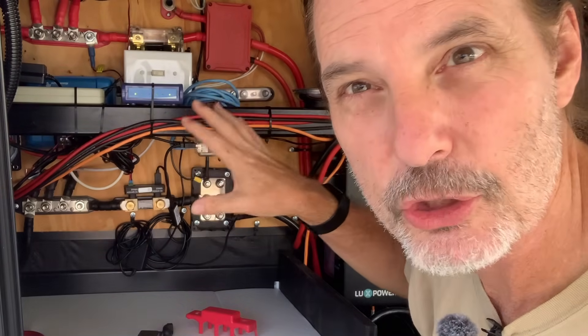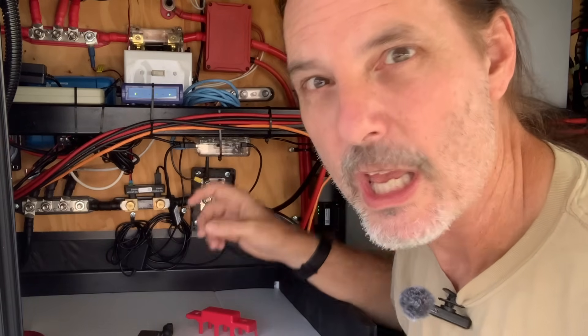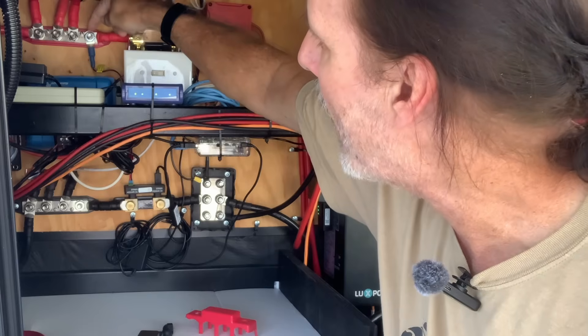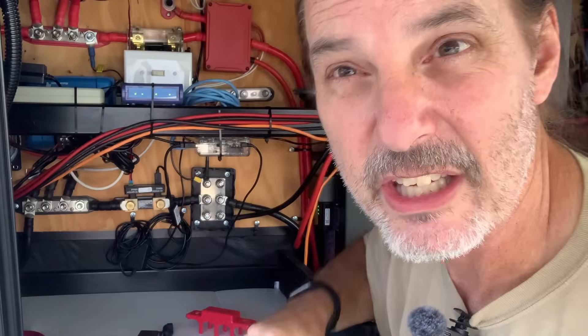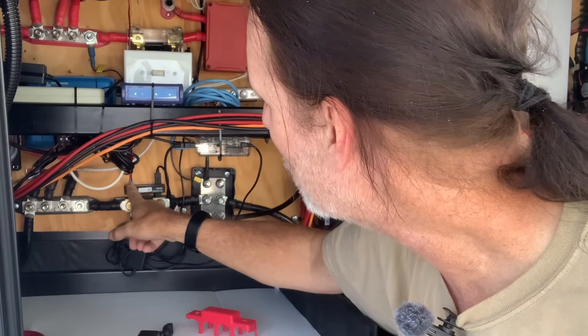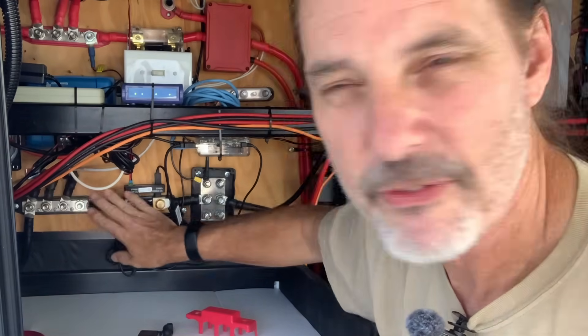I measured all of this equipment to make sure that was the right spot — I didn't just guess. I determined which spot was the weakest point and created the most heat. It makes sense that coming off this fuse from the main bus bar is where the most power hits. This is a 1-aught cable made with marine-grade wire that can support up to 250 amps, but it's still the hottest place. I've seen it reach as high as 190°F even at as low as 120 amps. You need to be very careful to put those monitors where they belong. The temperature sensor add-on is about an extra $30.